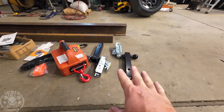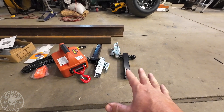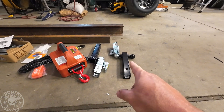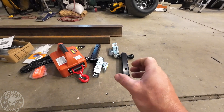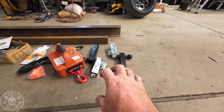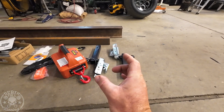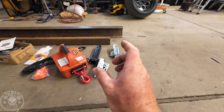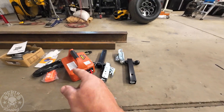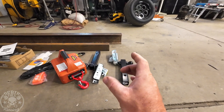This is how we're going to pivot the jib. It's actually a really clever and easy way of doing a pivoting joint instead of using a bearing — you're basically using sphericals. With a four-bolt flange bearing, if they're not perfectly aligned, every time you swing your hoist it's going to pop, and eventually you'll wear it out because they're only meant to adjust once.